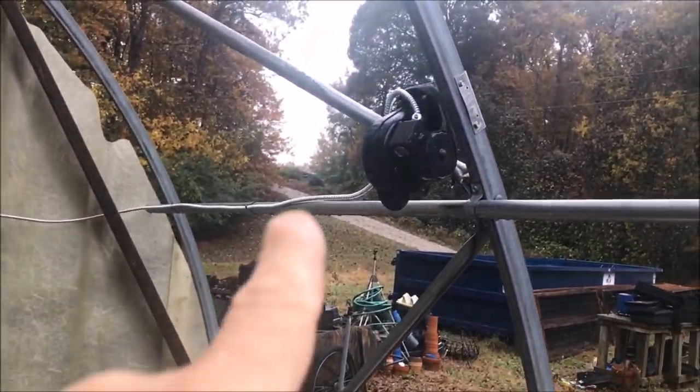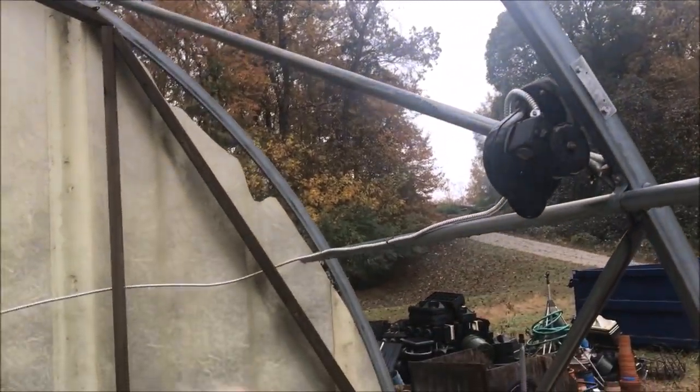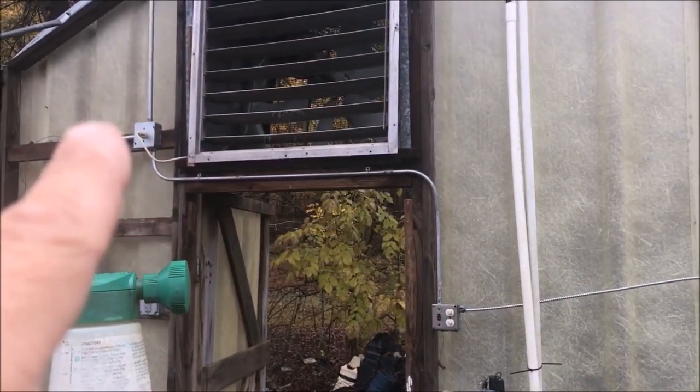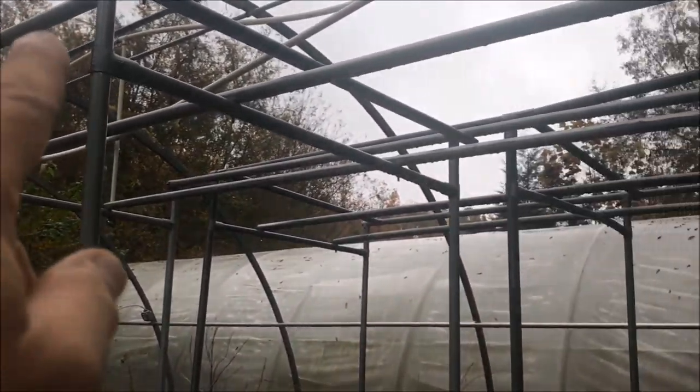I'm going to start by removing this purlin here. This particular fan — the blower for inflating the layers — is on the second purlin from the end. There's the end one, there's the first one, and there's a brace that goes from the end purlin to the top that's got to come off. This is run all the way over to a light switch, and it comes up and over to a junction box, goes all the way down to feed that side with the lights in the middle — which will end up being fluorescent in my building. It also comes down to the feed right here.